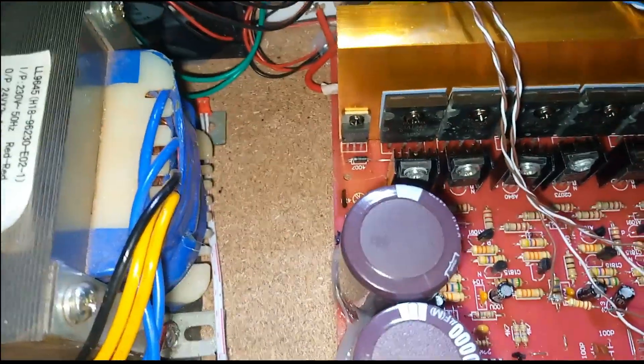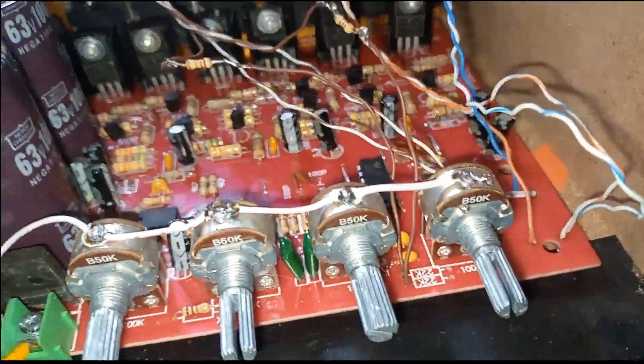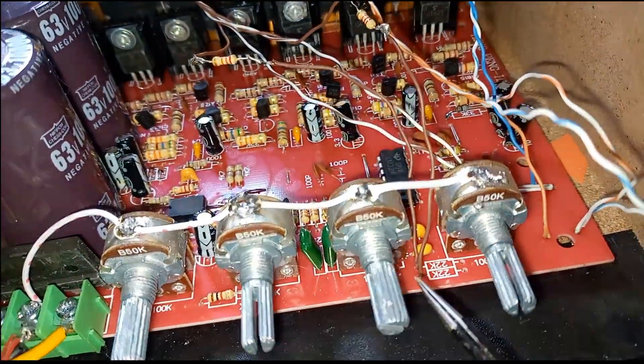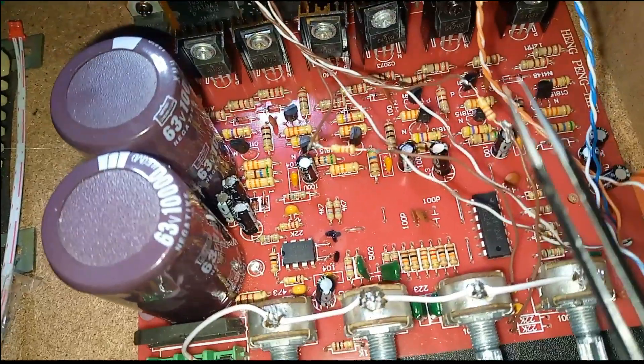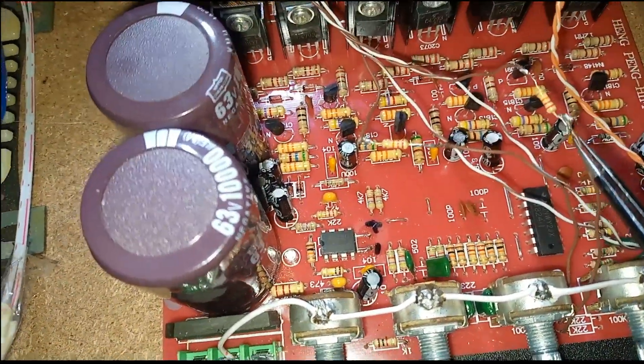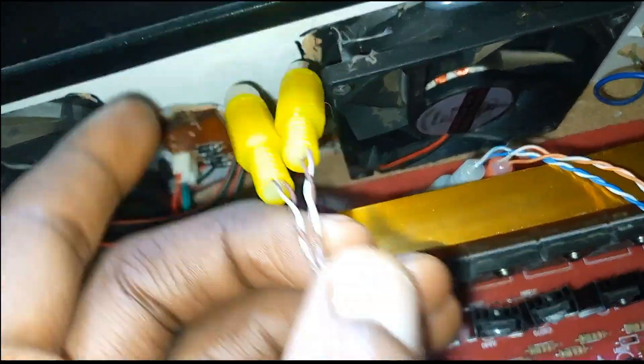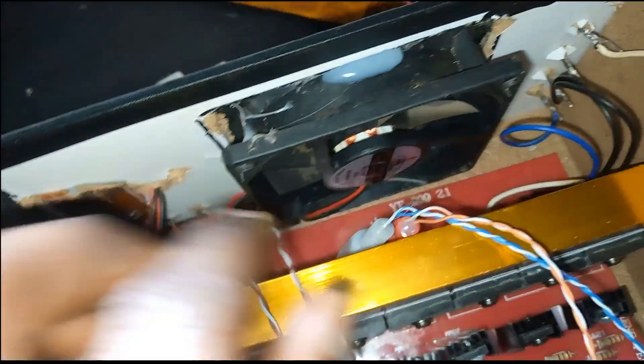To connect, let's start with the bass part. Bass is filtered by these 22k ohm resistors. I normally remove them and connect to the signal cables right over there. Remember, white is ground. These brown wires are for bass, and I can use yellow so that I can differentiate them from the mids.